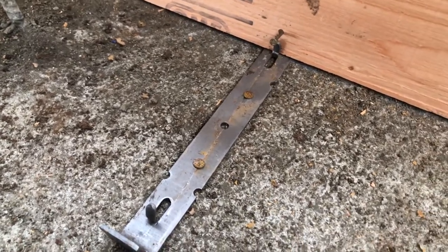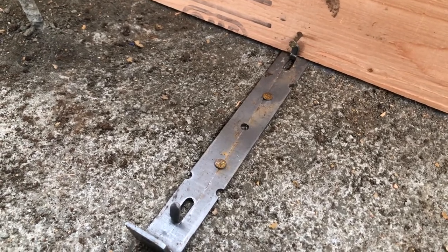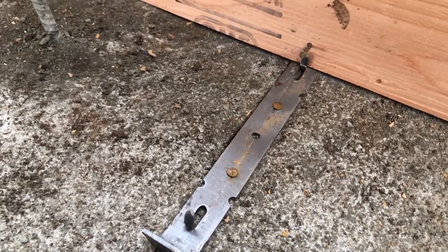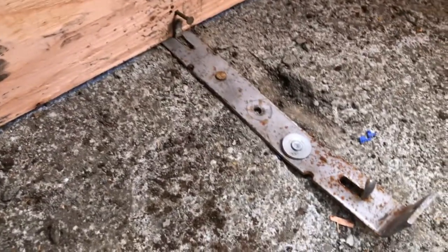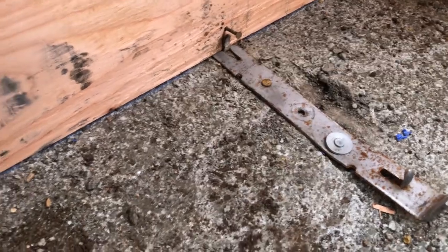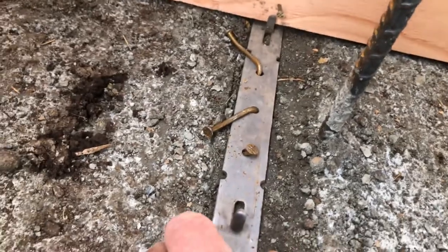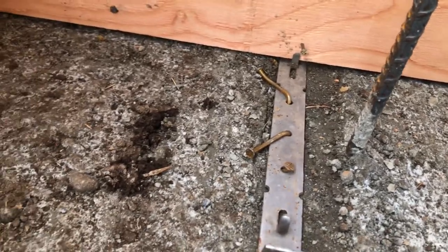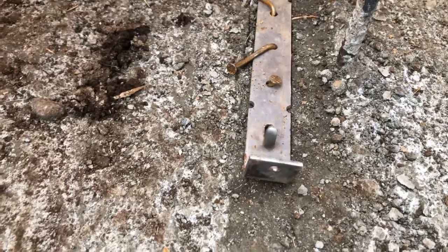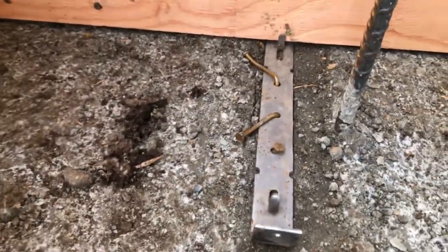At the time when I was told that, our concrete had cured too fast, and there was no possible way we were driving nails into it. But I gave that a try here after I shot that with the powder actuated gun, and lo and behold, that worked great. You get a few where you hit a piece of aggregate and that nail's not going in any further, but that clip doesn't move. So those nails held good enough, plenty good to hold the forms in.